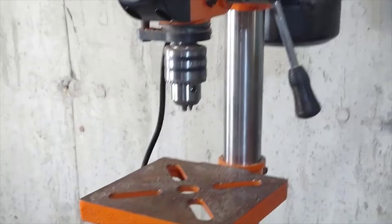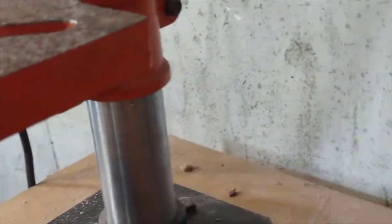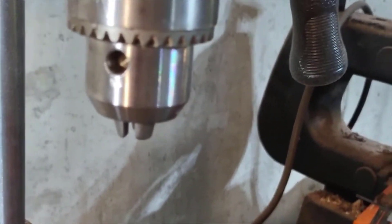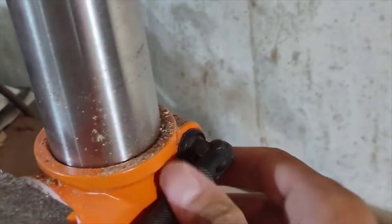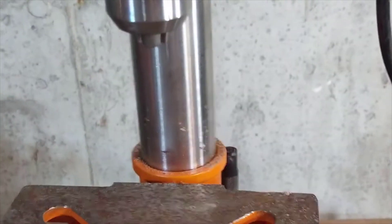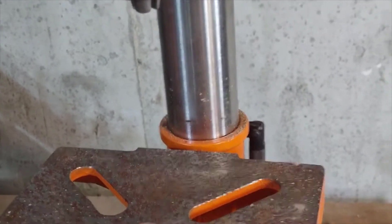Cons: really the only thing that's missing from this drill press that I'd really like to have — the one thing — is there's no crank for this table. I've since used nicer drill presses and they have little cranks where you can really fine-tune the distance from the bit and dial the table up and down. As it stands, it's kind of a two-handed endeavor. You loosen it, position it with your other hand, and then crank it back. So it's a little tricky adjusting height and fine-tuning things — it can take a couple of tries, and this sucker is heavy with a little inertia against the pole, so it can take some force to get moving.